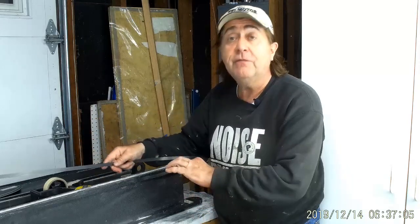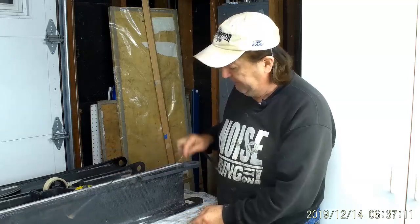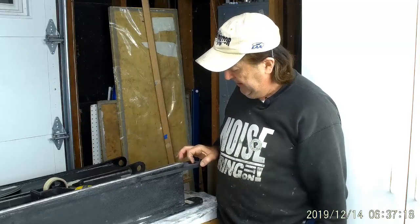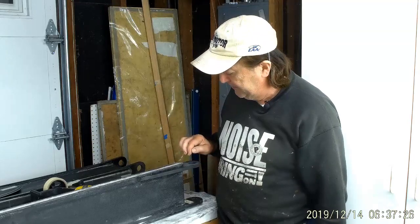So two of them together, 2,400 pounds. Two sides, 4,800 pounds. So we've added 4,800 pounds of load that we can carry in this fitting just due to these two strips that I'm adding. Now, the fitting here, it's about a 1/2 inch by 3/4 of an inch, and that's good to about 70,000 PSI for this rated material.